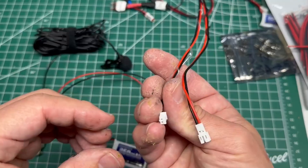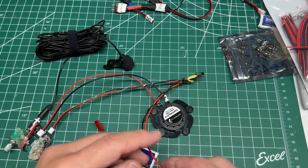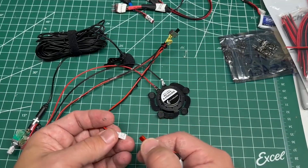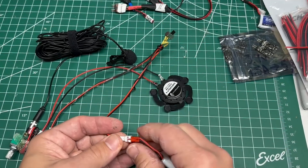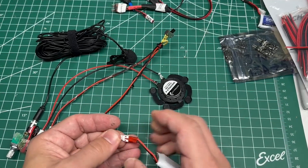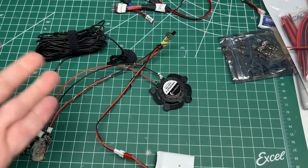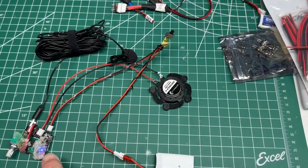This has an input — a female part and a male part. I actually used a PH cable rather than XH, so it's a little smaller — the 2.0 millimeter rather than 2.54. I line up my power positive. It looks like this is maybe a little big for this one, but there are other ones that would fit and it can still pass the signal. So I turn it on and now we've got power — this is a nice capability to have.